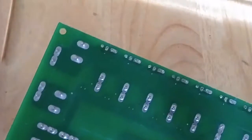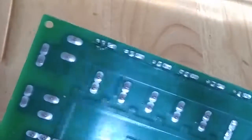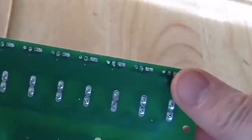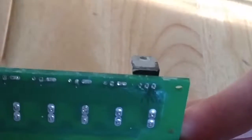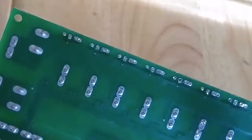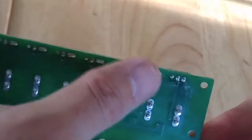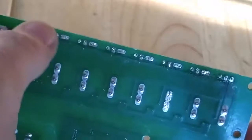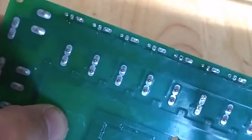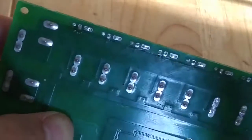Now I have these to clean, and I'll put the AC controllers in after I get these holes cleaned out — except for this one, number 16, which already has the chip in it. I'll clean these out and use my solder wick to take some of this extra solder out. Once I've got the legs and lands clean, I'll use my toothpick, heat them up, open the holes up, and check to make sure the AC controllers go in.